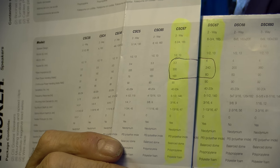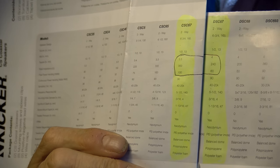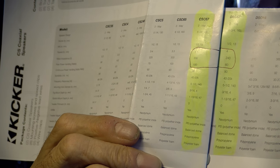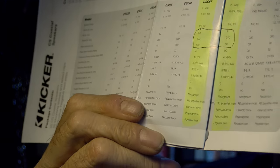I've got a funny story. I was testing some 6x9 loudspeakers on domestic equipment — I had some Rockford Fosgates. Wow, were they loud. Then my home equipment blew up, and that was when I realized looking at the specification they were only 3 ohms. They were just too low in impedance to allow my amplifier not to kill itself. And, frankly, yes, that's exactly what happened.